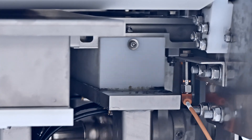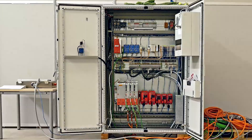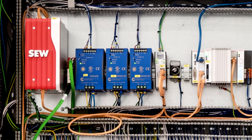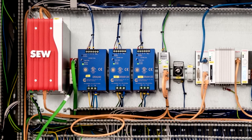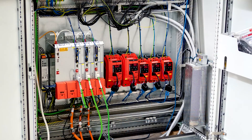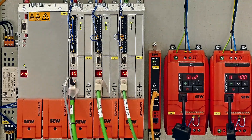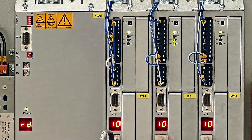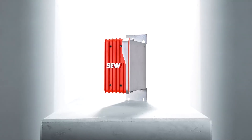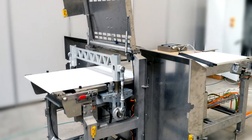Modular hardware coordinates all the motion sequences centrally. It is based on a multi-axis servo system with Movi PLC Power Motion and Logic Controller and a network of three Movi AXS servo inverters that are controlled synchronously at millisecond intervals. All the necessary motion profiles are calculated centrally in the motion controller and precisely maintain the machine's limit values.